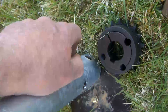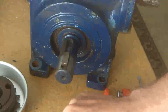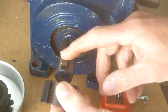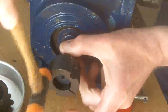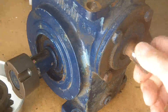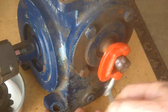I know where I'm going now. I've got the keyway — that's what's called the key — and I've got some bits of cardboard here from a cornflake packet. I'm going to put that under one end of the key and take this inner collar — you can see the taper on there — and knock that on to lock it onto the shaft. A bit of cardboard just tightens it up. Then I'm getting this little G-clamp in here, which is going to go on there.